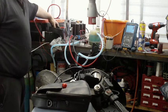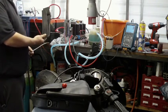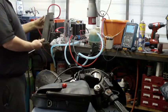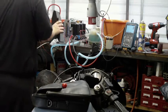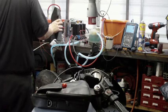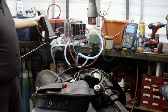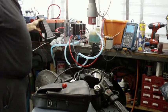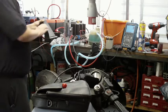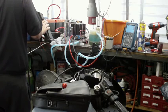But this is the fun part now. I can take my throttle pedal, right here, and I can just do this. We're now pumping 500 amps, well 513 amps actually, out through the motor terminals into the inductor bank. It's starting to bubble inside the bucket, bubbling buckets. And I've got very clean switching going on here. I've got 513 motor amps for 79 battery amps.